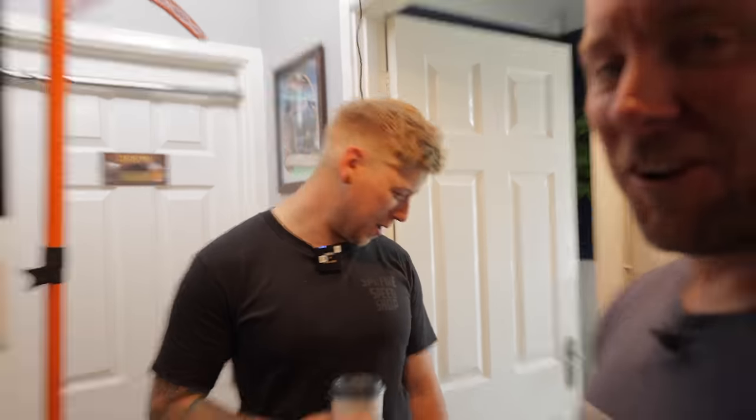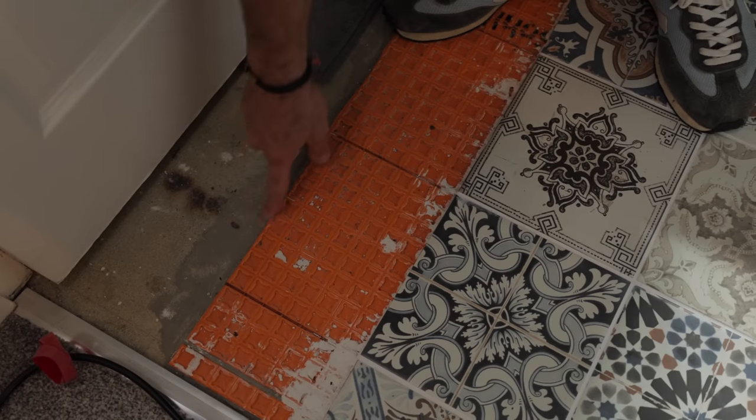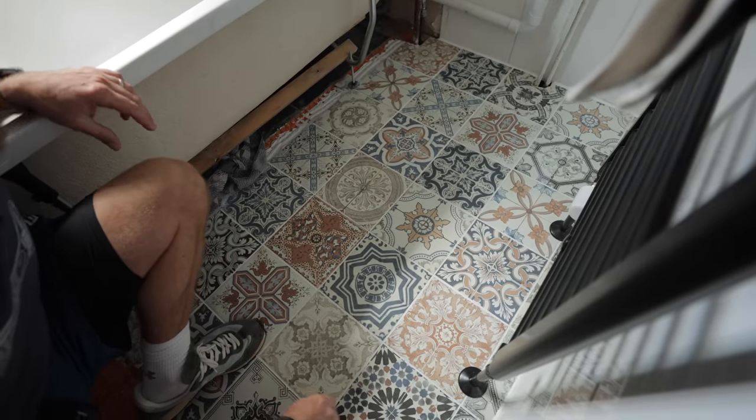Lee's also attempted to do some tiling today. Let's have a quick look. I like the fact that he's laid down a separation layer and glued it down properly. That glue is a nightmare when you comb it out — there's no going back. He's back buttered the tiling as well. There's a lot of dust and fur around there — he's just got a dog. What do you think of Lee's new hairdo? He's just had his bumps.